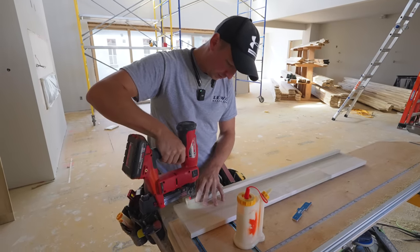If the joint isn't coming together as well as you want, take a pinch dog and hammer it into place. You can see that draws the joint together really tight, and that clamping pressure is what you want for a strong long-term glue joint. This will all be painted, so we do not want that joint to crack and create an ugly hairline dark crack over time.